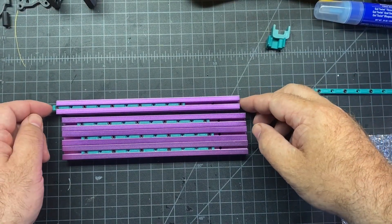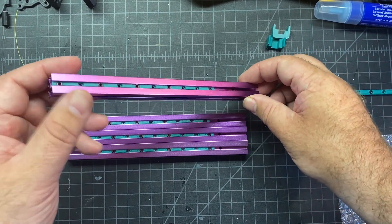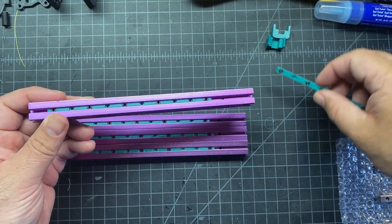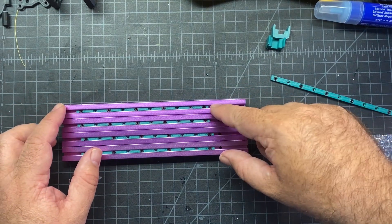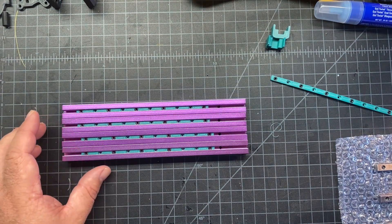I've just about inserted all the nut carriers. This last one just slides right in really easily, at least on mine. You can move them up and position them roughly — we're not going to get real precise yet, but the rails sitting on here are going to need to have a 38 millimeter distance from the end of the rail, which we'll be checking in a minute.